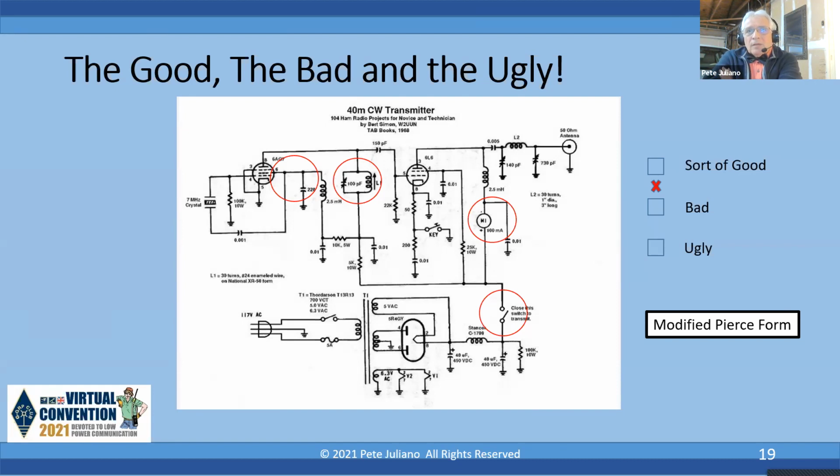Again, the panel meter with the high voltage on it could be a risk to you personally. Everything underneath the chassis is protected by the chassis itself, but you've got that panel meter with some high voltage on it. These are things you need to look at when you're reviewing these circuits. And it's not unlike what you do with solid state. With solid state, you have to worry about ins and outs. You've got to keep the ins separated from the outs. So it's the same kind of process as you look at schematics and the physical construction and what you need to do. Okay, next slide.